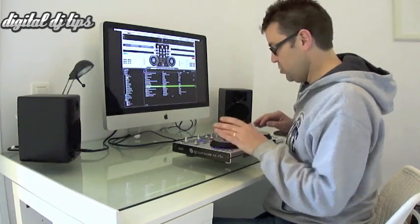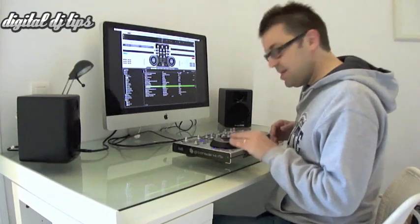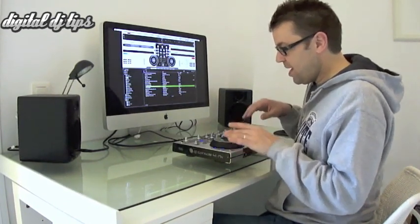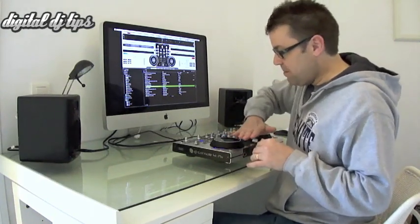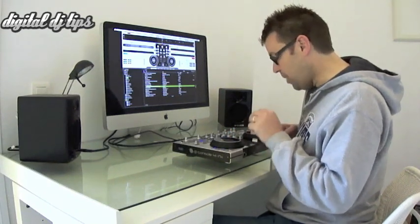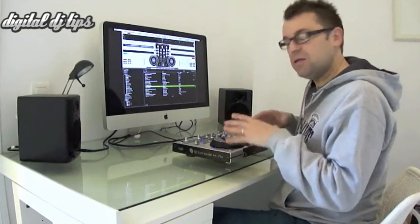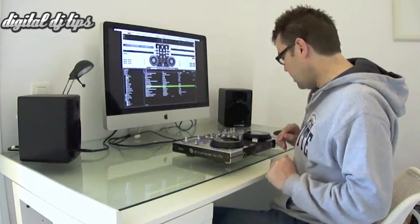That's really unusual to have give in a jog wheel. Normally if there's any give, it feels like they haven't been made particularly well, and the best DJ controllers don't have any give at all. However, these deliberately have that bit of give, and I actually think that's brilliant because it gives you some kind of tactile feel — you can feel when you press it physically. Other DJ controllers use a sensor underneath, or like the Vestax ones, a metal sheet with a capacitive electronic system that feels your fingers. The Traktor Control S4 has a little click when you press it. Hercules have just decided to unclamp it underneath so there's movement built in. Records are like that — they move and you can push down. It just feels good. I really like the jog wheels on this unit. Jog wheels are very important in DJing — DJing is about two spinning things, and to have great jog wheels that are fun to use is excellent.